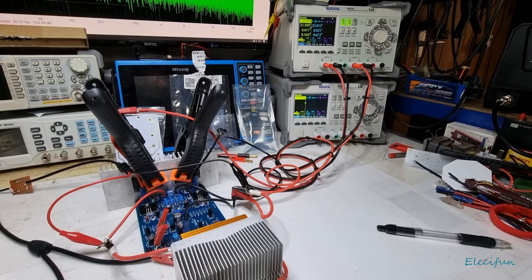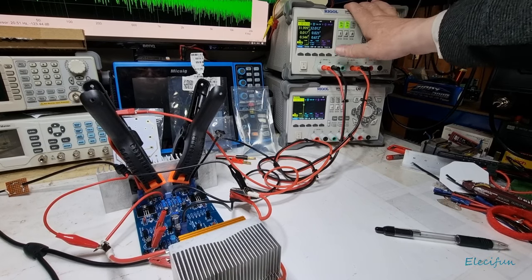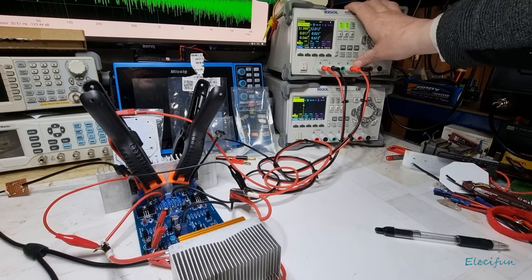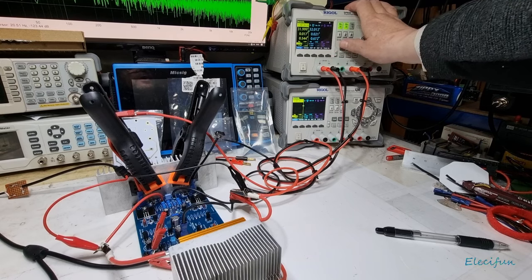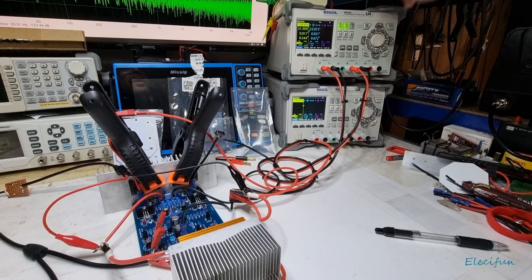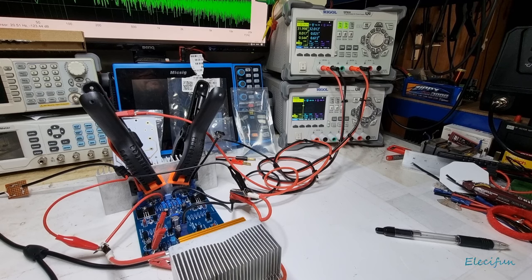If you got this far, thank you very much for watching. I hope everybody with one of the older ones will realize they've got noise. I don't know how they managed to come out with those specifications — I think in the ideal world it's 350 microvolts noise and ripple RMS. And as shown earlier in the video, this one has never had the caps on the back bridging to earth like the other one does, in order to get rid of that AC. So yeah — ideal world, I suppose. Right, enough of that — see you in the next one. Thanks for watching, bye-bye for now, take care everybody.